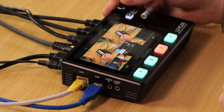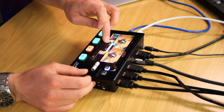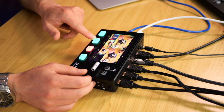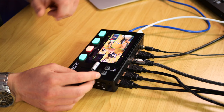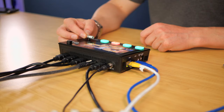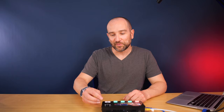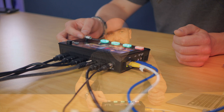If you go back up to mode, you can change this to T-bar mode, which lets you use the physical T-bar to manually control the transition. The red light indicates what's going out to the audience. Select your next source, and as you bring the T-bar down — at your own speed — it will transition smoothly. Even if you're not that smooth with the T-bar, it still looks smooth going out to the audience, which is a nice touch.